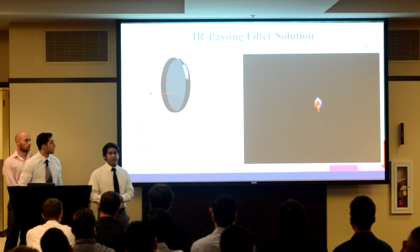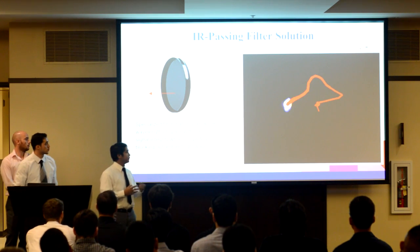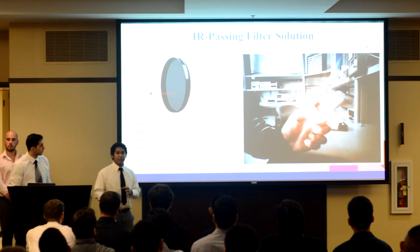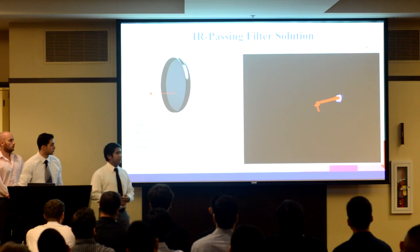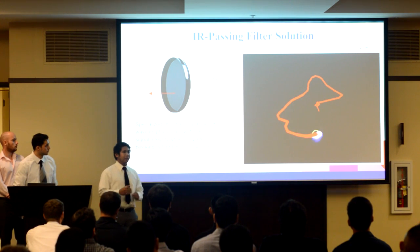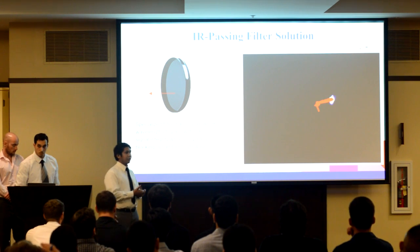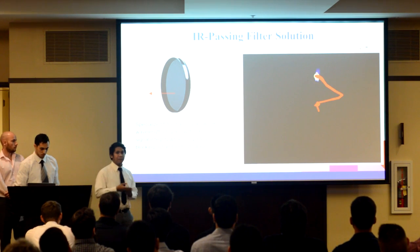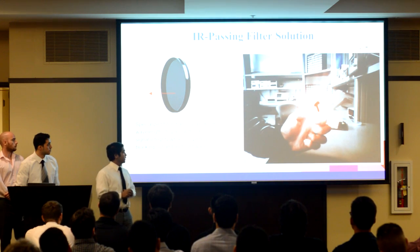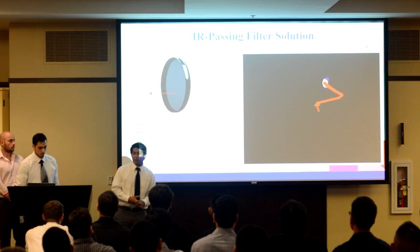The biggest challenge in depending on HSB was that other light sources would actually confuse our algorithm, such as the ceiling lights or reflections off tiles. Therefore, we had to implement secondary hardware with this specialized filter. This specialized filter actually allows the integrity of infrared light frequencies to pass through it while still blocking out all ambient light. And with the detection data, we pass it on to the PIC microcontroller, which Vince will talk about.